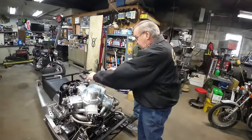So I made a buck out of a piece of steel out of the junk. I put this in the press with a fitting on it so it couldn't distort the threads, put that in there and pushed this down with the press. And that's what you get. That is ingenious, Paul. It worked, and he was ecstatic. It looks a lot better than just five round tubes. Paul, I would have thought you'd cut and welded and ground and polished. That's so clever versus spending all that time.